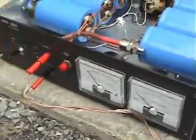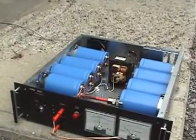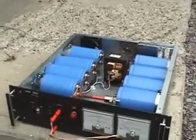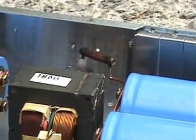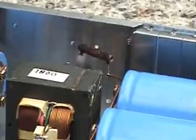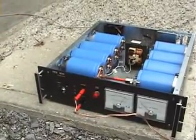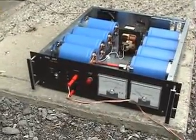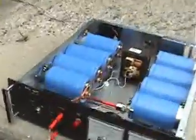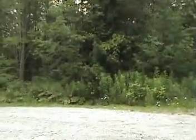We're on round number three. Let's watch that resistor glow red hot again. It's not turning quite as red this time — yep, there it is, it's turning red. Let's zoom in on the red hot resistor. At 1,000 ohms at 1,000 volts, we'll limit the charging current to 1 amp, which would be 1,000 watts. The capacitors are getting much better at charging up — they came right up to 800 volts for test firing number three. We're getting a good 30 feet of lift at least.